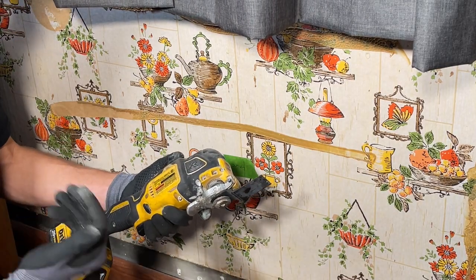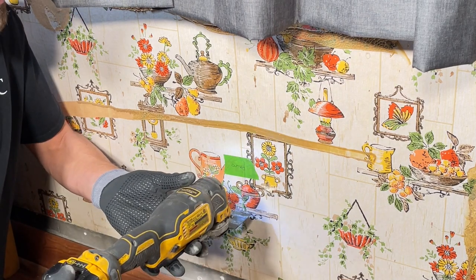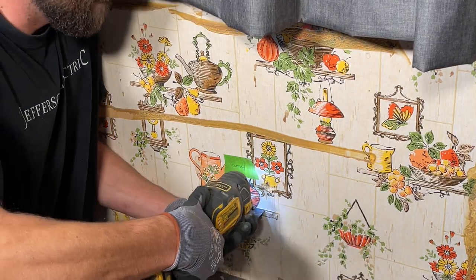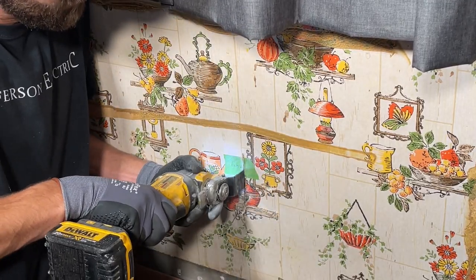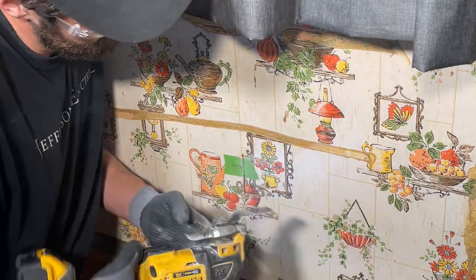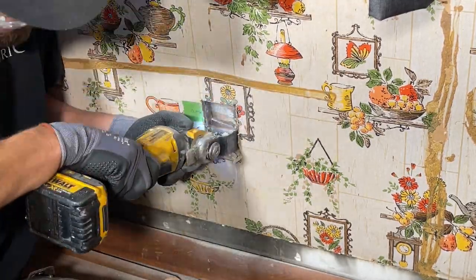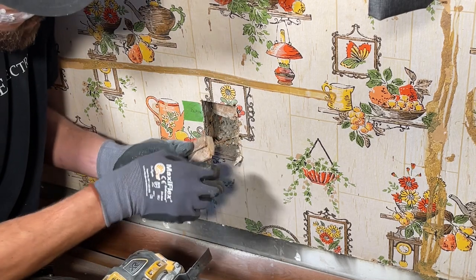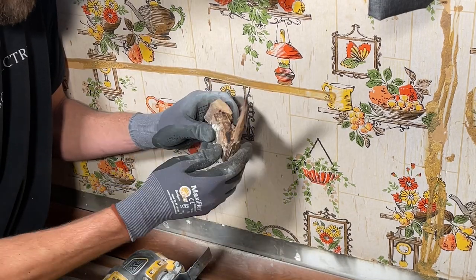I'm utilizing an oscillator, and I'll give you a trick to extend the life of the blade. If you're getting through plaster and lath with a jab saw, it's a long hard day — which is why I'm using this power tool. What I'm going to do is almost like a hammer action: use the side of my blade to score the cut and get through the plaster. Pro tip: go slow, take it easy. Under heavy pressure, the oscillator won't perform and you'll put the blade in a bind. If you keep lightweight pressure, it'll actually accelerate the cut. We've got a good clean hole. Watch out for overcut — the only thing holding your box to the surface on the front side are these four tabs. If you cut beyond that, the project just became 3x more difficult.